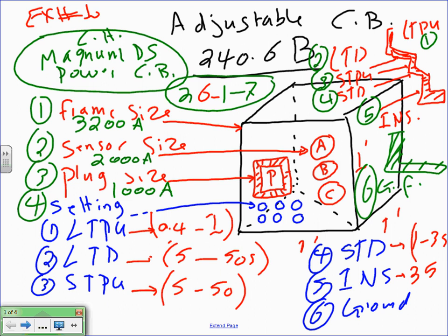The horizontal axis is always the current; the vertical axis is the time. So you have three current settings. Then they also have delay times: long time delay — how long you want to allow the overload to stay in your building; short time delay — how long you want the ground fault to sit in your system, five cycles or ten cycles; and instantaneous — within three cycles, the circuit breaker trips. Three cycles is 1/20th of a second. You can adjust any one of them.